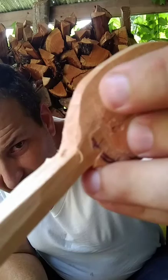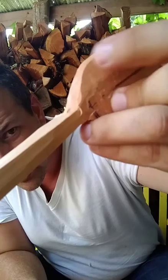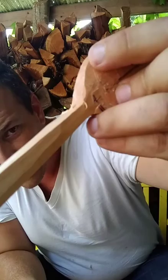The other thing I want to make sure I do is completely eliminate that axe mark. See how there's an axe mark right there, and that bit of clear wood between the end of the axe mark and the rim. That part is super important — I need to make sure I establish that clear wood between the axe mark and the rim. I need to go down until I have that couple of millimeters of clear wood.